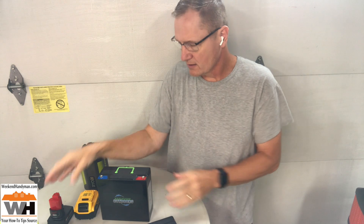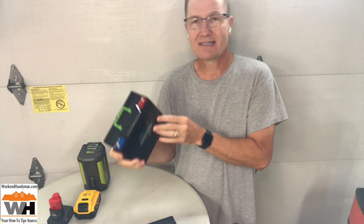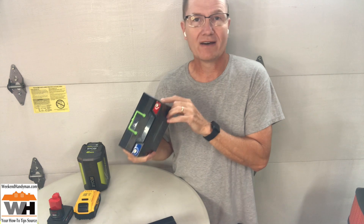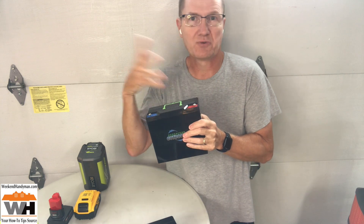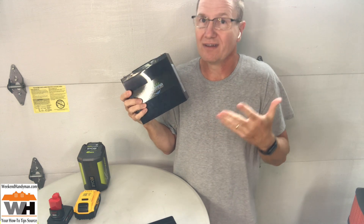Now of the batteries here, you'll see there are different sizes and different things. This is a 12-volt lithium-based battery, and this has a 27-amp hour capacity. This particular one actually already tells us that it has 345 watts available. So running a 12-volt device, this is going to be able to run that device for a long, long time if it's a 10-watt thing.